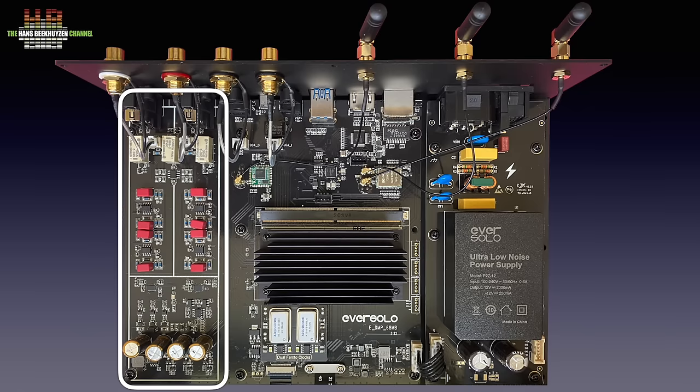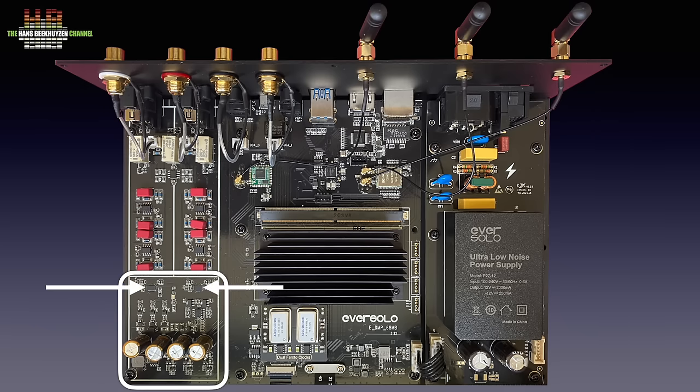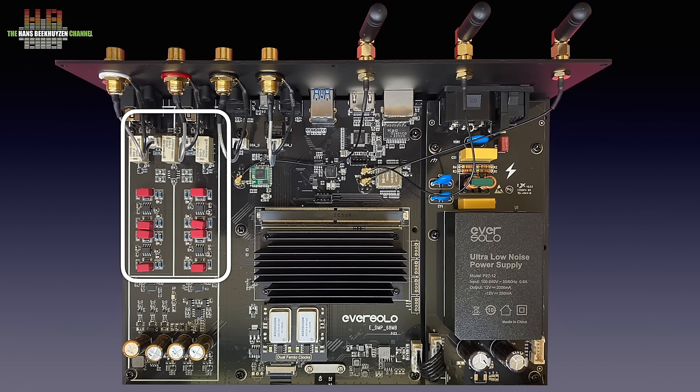The analog section is on the same circuit board but is galvanically separated from the digital section. This is the circuitry around the two ES9038Q2M DAC chips, one per channel. The balanced outputs are kept balanced using the ultra-low noise OPA1612 op-amps, another upgrade from the standard model that uses OPA1642s. The balanced signal is sent to the XLRs directly and via another op-amp to the single-ended outputs.